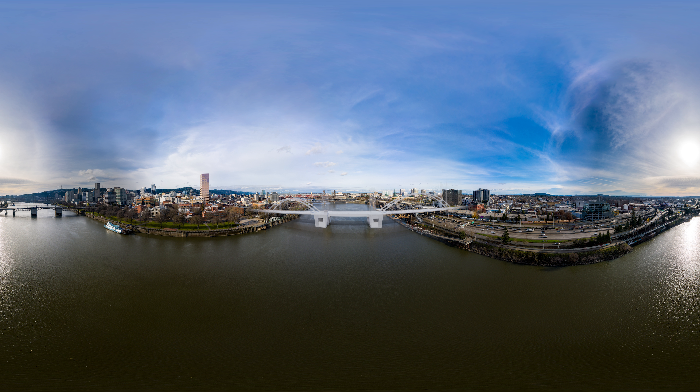Now let's see the vertical lift. Cables supported by towers raise the span. The Hawthorne and Steel Bridges in downtown Portland are also vertical lift bridges. As you can see, the counterweights are above the deck, requiring tall towers to secure them. This will impact views compared to today's bridge, which has no towers. Another key difference is vertical clearance — it would be limited, but since there are vertical lift bridges up and downstream from the Burnside Bridge, this limitation would not impact river traffic.